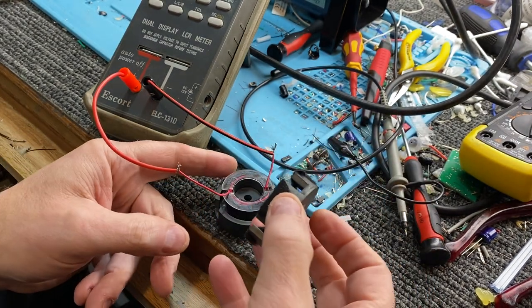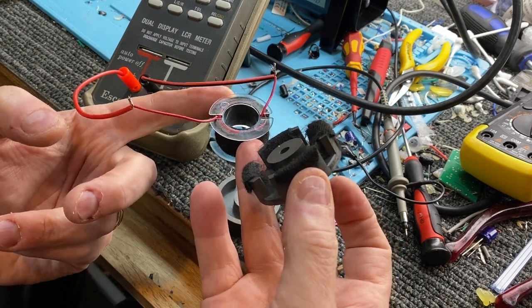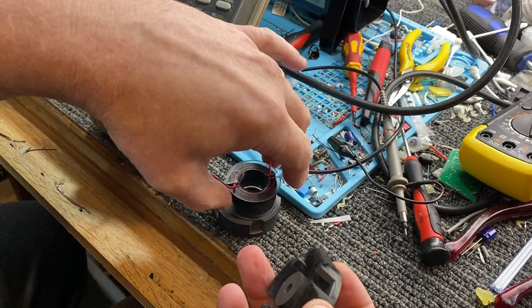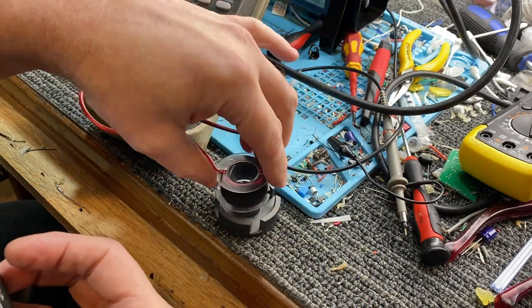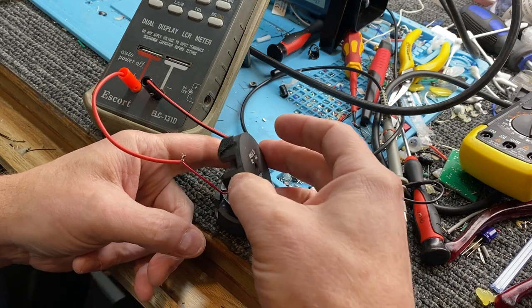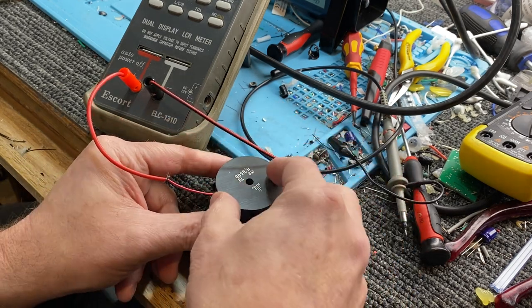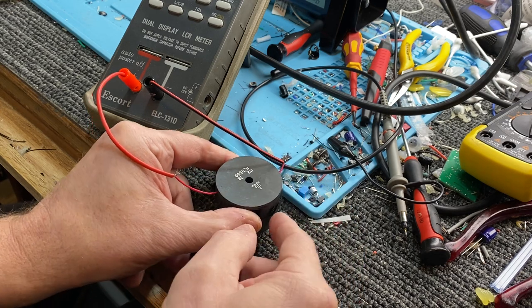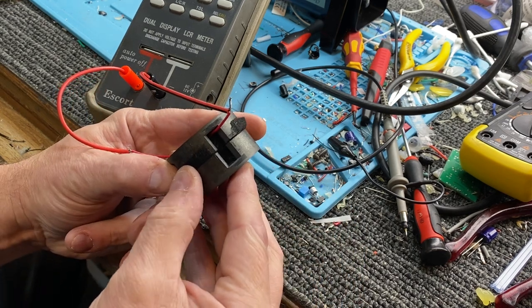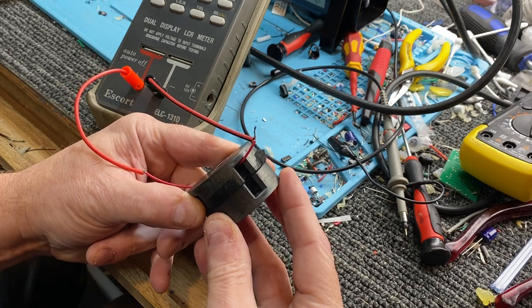We get this — we've got our 26 or 27 turns of that wire on this bobbin. They call these bobbins, like a sewing machine type bobbin. We get this and make sure we don't squash the wires, because it's got little openings for the wires to go through. It's got little windows, see? And it doesn't make much difference if it does that — it still works the same.